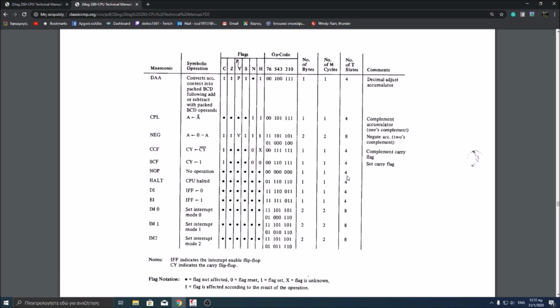So the timing diagram and the breadboard and this piece of paper also correspond with what we built. So everything is working as intended. So every time the CPU reads from the hypothetical ROM, actually every time it reads the same instruction over and over again, which is no operation, and the CPU does nothing and sits there in an endless loop.